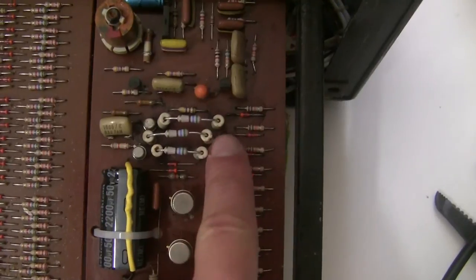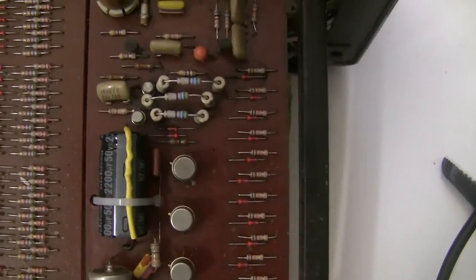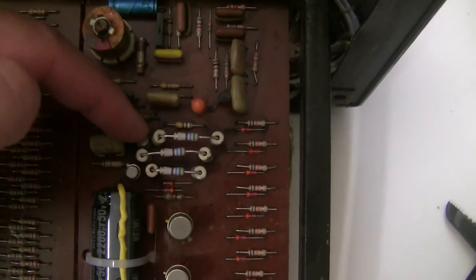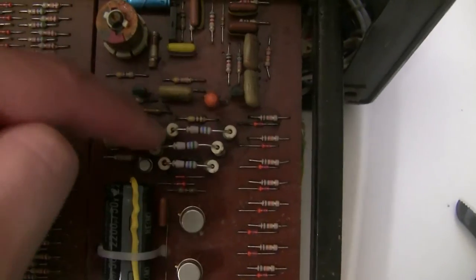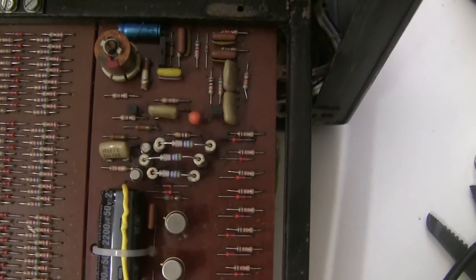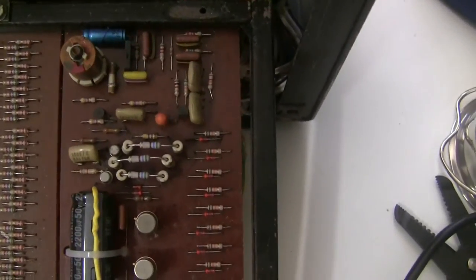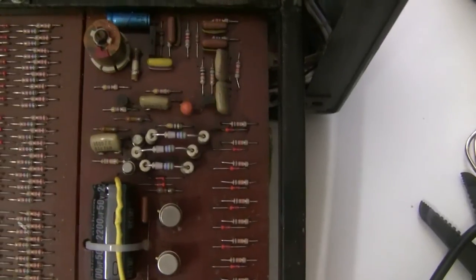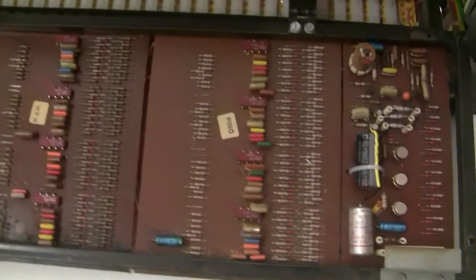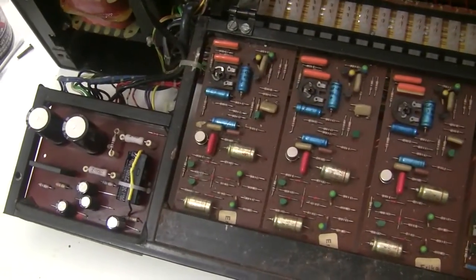that holds these ceramic standoffs in place, but the glue seemed to have damaged the leads for this transistor, and so when I had these resistors off, I found that this transistor only had one lead connected. So I desoldered it and soldered it a little closer to the board so the leads could get through, and we'll have to see if that still works once we fire this up. But as far as the power supply is concerned, we're done with this tray of the board, and we're going to move on to the next one,